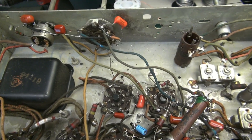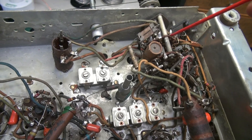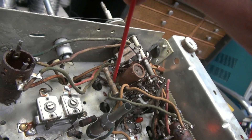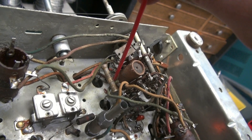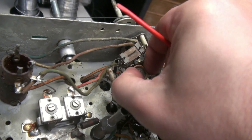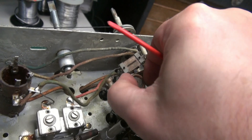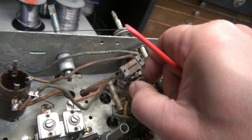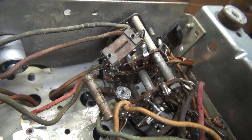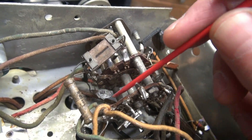The capacitor changeout is doing well. You can see I've got most of them in. I'm doing the last one, which is trapped between the wafers on this band switch. I was able to cut this wire off, but I can't get to the wire that's buried under there. When you have this circumstance, rather than trying to get some cutters in there and damaging things, just grab ahold of this guy and start turning him. Just keep on turning that cap and eventually you'll fatigue that lead and she'll come out. I had to get a pair of pliers so I could get that guy spinning. Now I can remove that and I'll have full access to that lead.